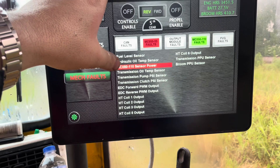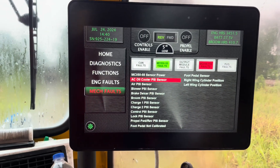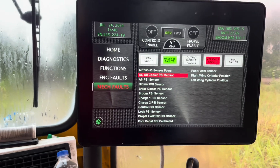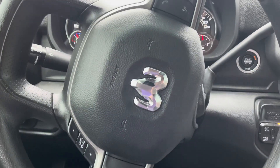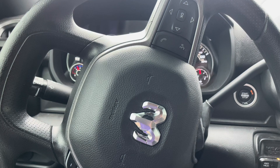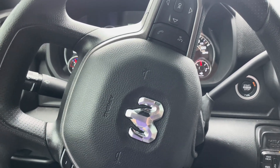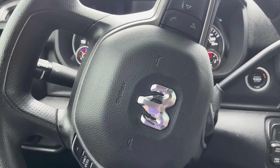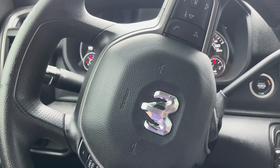The faults that are showing now — sensor power and AC, cooler, PSI sensor — those actually don't belong on this machine. This machine was made before that. I think somebody updated the modules and didn't bother to turn that off. I'm going to hook my Plus One to it and see if I can turn it off. The program wasn't alterable for that, so we couldn't do anything about it. Those first few machines made didn't have all those options, but the same program was used on all of them. I brought it to the engineer's attention that we should create a different program for those first five so they don't have that problem anymore. The customer is still happy overall, and everything else is fixed.